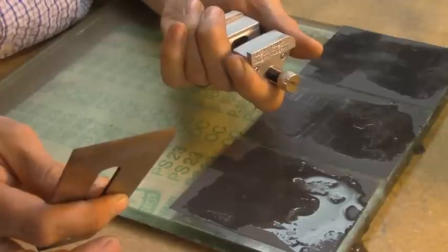I'm a big fan of the sandpaper method for people who are just starting out. It's how I started out - it's relatively easy, gives predictable repeatable results, and you get blades that you can do real woodworking with. The only problem is that you end up with some false economy after you've been using it for a while. These packages of wet and dry paper aren't cheap - three to five dollars at the auto parts store. You're not going to want to keep spending money on abrasive paper over and over throughout years of woodworking. Eventually you're going to need something more durable and more affordable.